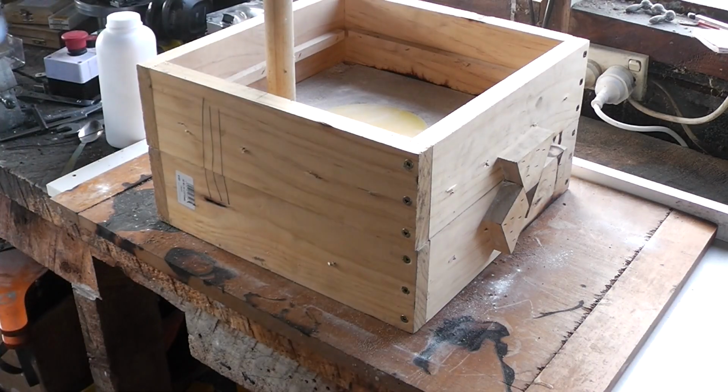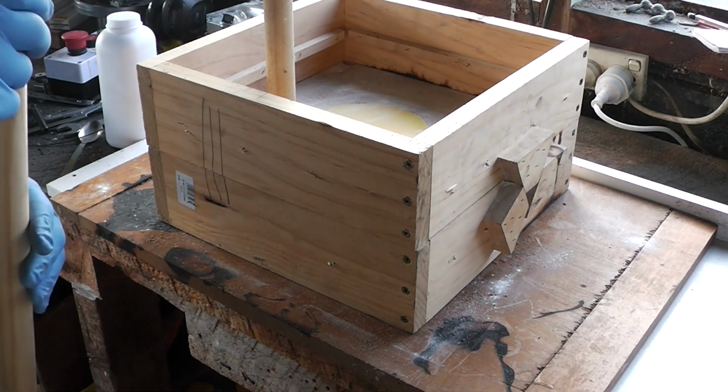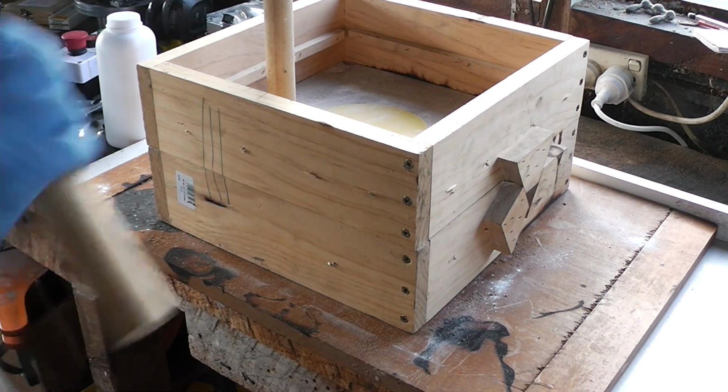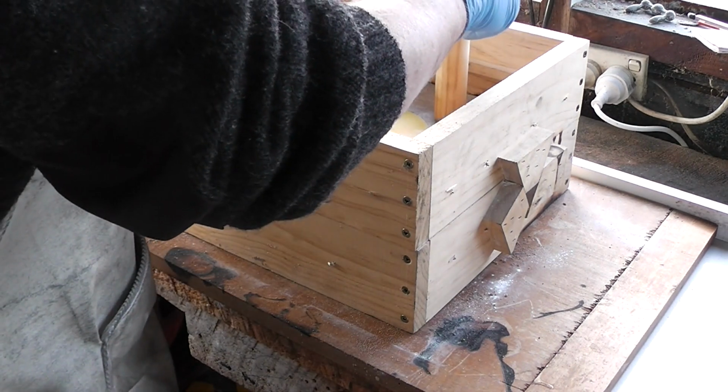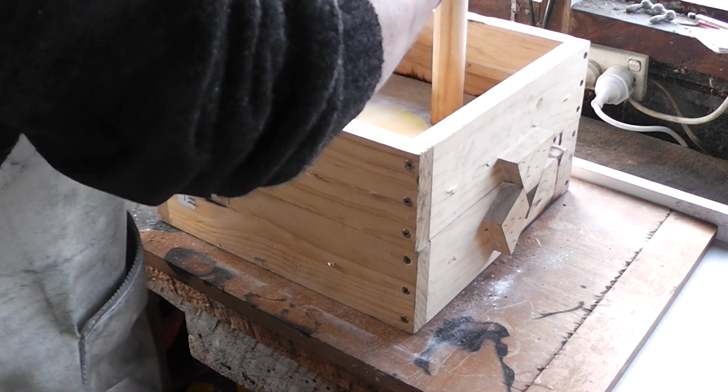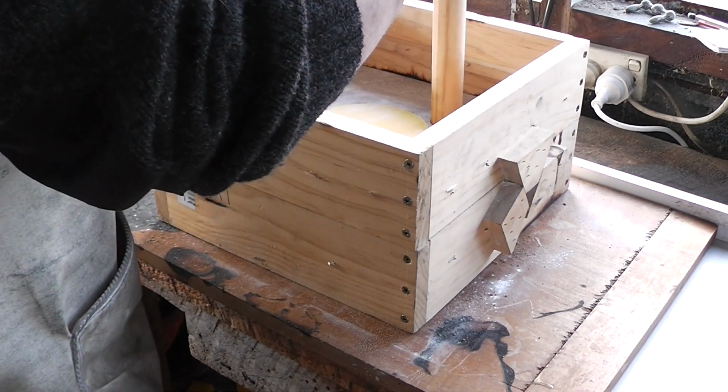It's a relatively thick casting, so I'm going to use a big gate, and I'm going to use a really big feeder, partly because I also want to make some 32mm stock while I'm at it, which is why this feeder is going to be so chonky.